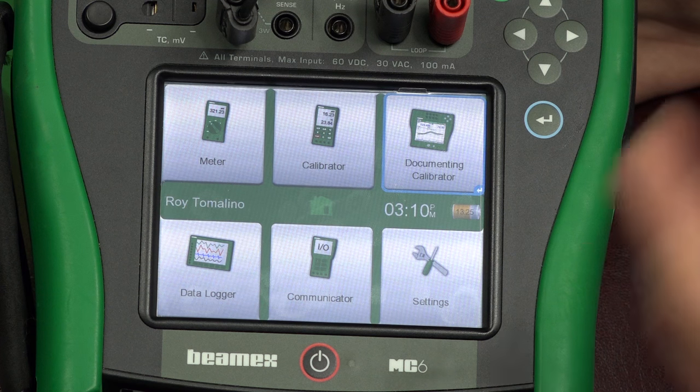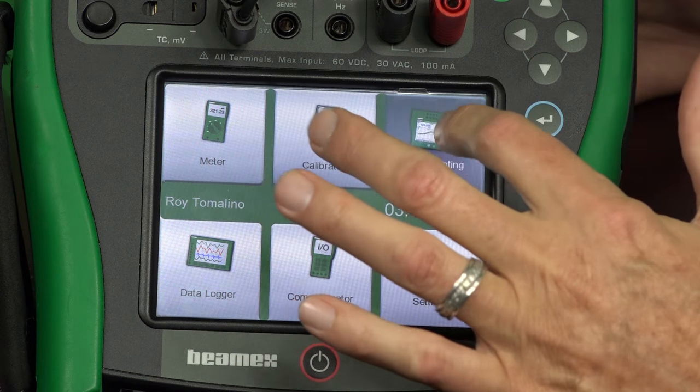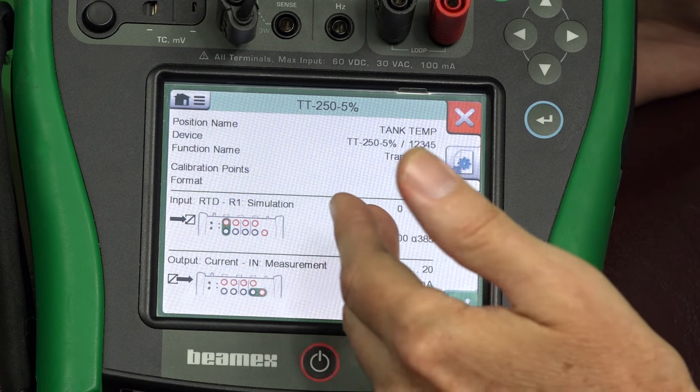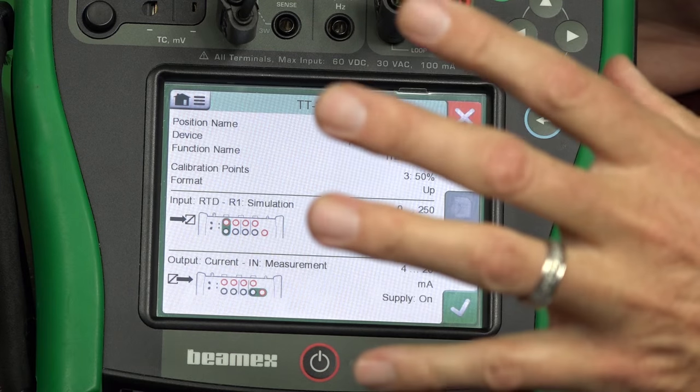Let me give you an example of what I'm talking about. Let me show you what I'm talking about with the test that I've set up. So on this calibrator, I've got an RTD transmitter connected. I want to perform the same test two different ways — the only difference between the tests is the tolerance. On this transmitter test, I'm going to go from zero to 250 degrees with a tolerance of plus or minus 5%. Instrumentation is much better than that today. So 5% — how many degrees is that? It's a little over 10 degrees. I would equate it to throwing in an uneven scoop — it calls for one and two-thirds cup and you end up putting in two cups, or a tablespoon instead of a teaspoon. You're just being sloppy with the tolerance.